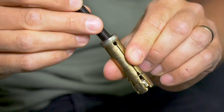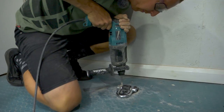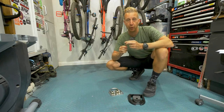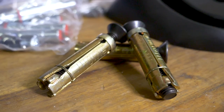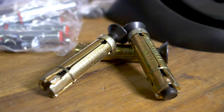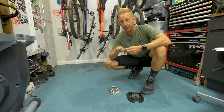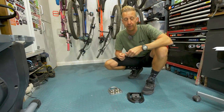This one uses proper concrete fixings. I have a solid concrete base here, so that is absolutely fine. However, if you don't have a solid concrete base — maybe you've put in some sort of filler — using these fixings is not a good idea because it can damage the concrete and weaken them. The idea is that these are a permanent fixing: once they're in, fit and forget until you dig the ground up to get them out.